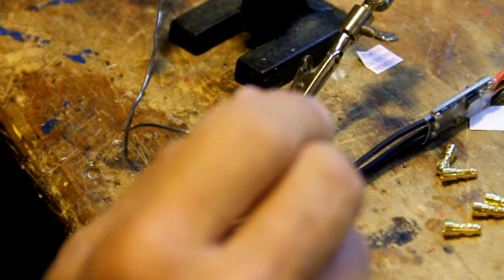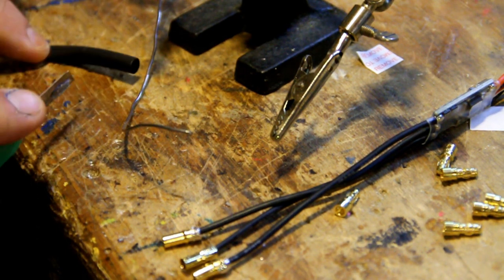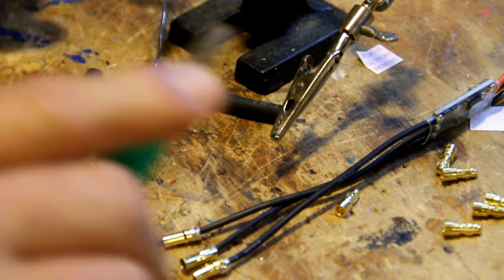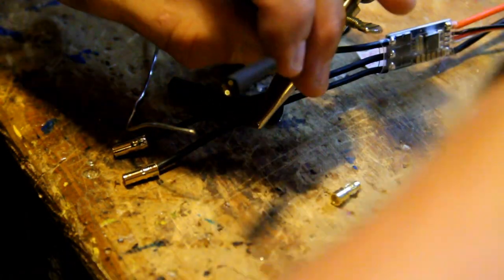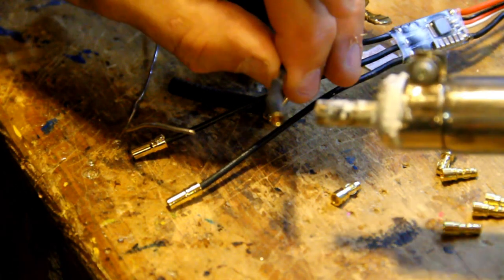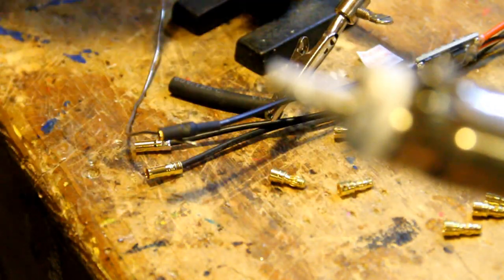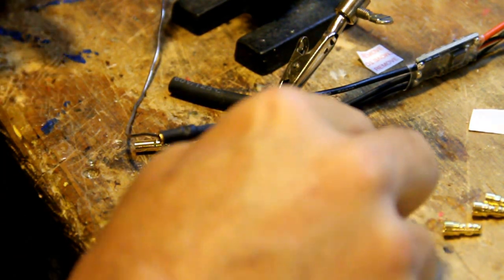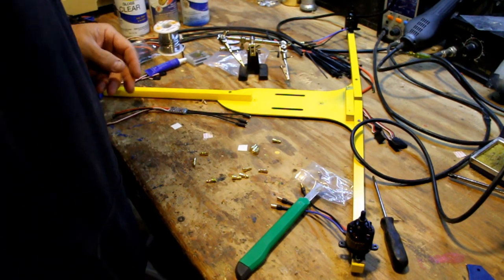If you're really good at soldering you can get away with 4mm heat shrink, but I usually have little bubbles on the side that need covering up. Cut the heat shrink long enough to cover it — just don't want stuff touching. If you don't have a fancy iron, take a lighter and heat it up; in my case I have the $100 soldering station with a heat gun to shrink it. We're going to do that on all nine connections. You're going to end up with leftover connectors — just put them in a jar.